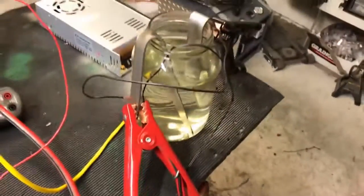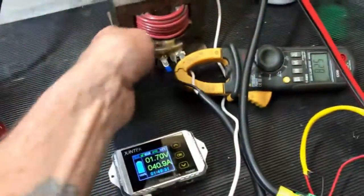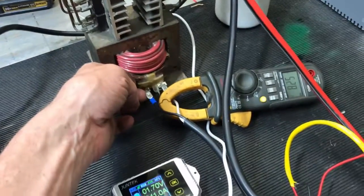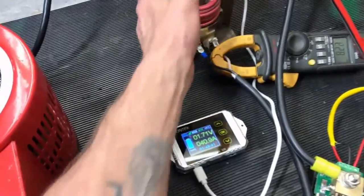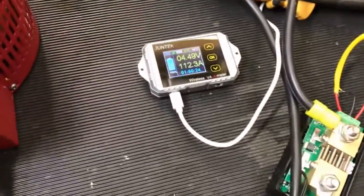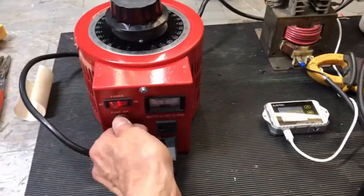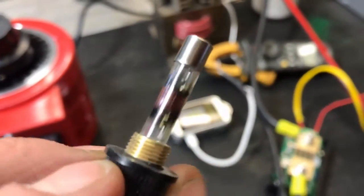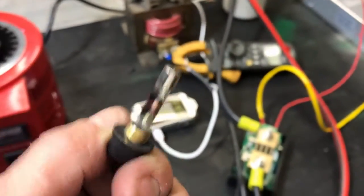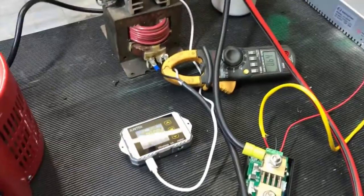There's 41 amps — that wire isn't quite burning up yet. We're putting 8 amps into the primary, which is not too bad. So this transformer is going to be fine at 40 amps. She's smoking now — let's just blow it up and see what it can do. Oh, I just blew a fuse. We hit about 130 amps and we nuked the wire. I think the fuse probably failed on us.